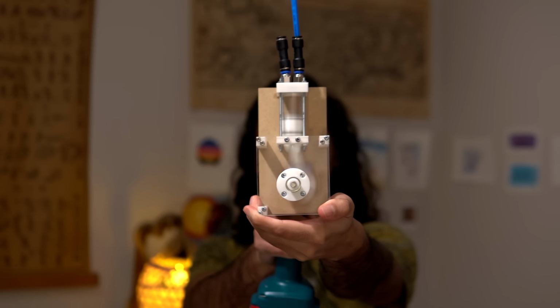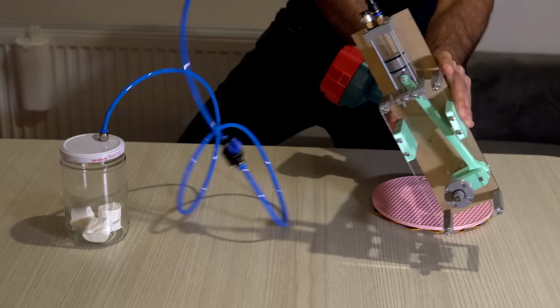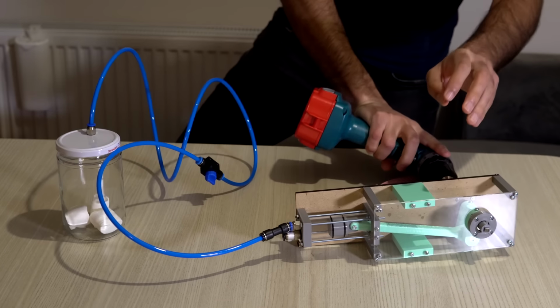Let's remember what were the setbacks of the old design and how are we gonna improve on them. Primary problem is the vibration, and there are two components to that. First one is caused by the inertia of the pistons. They are moving fast and changing directions all the time. The second type of vibration is caused by constantly changing torque requirements of the piston. I will call these ones kickbacks to differentiate the two.